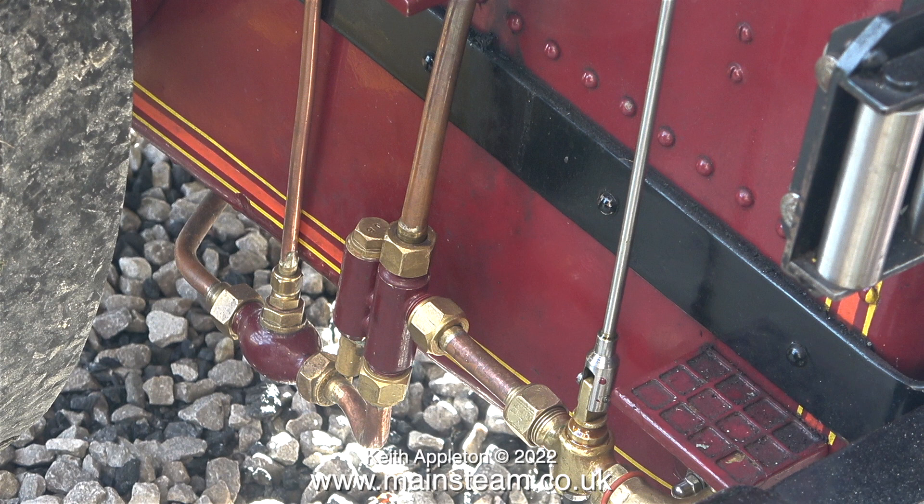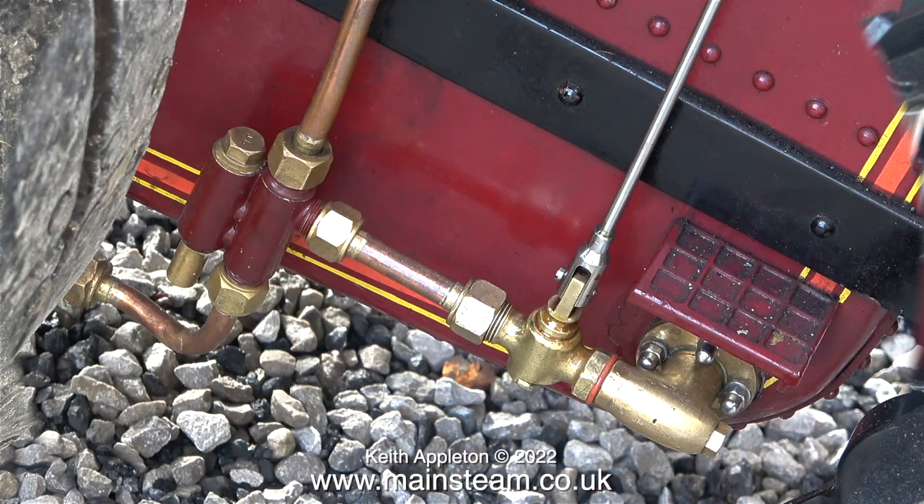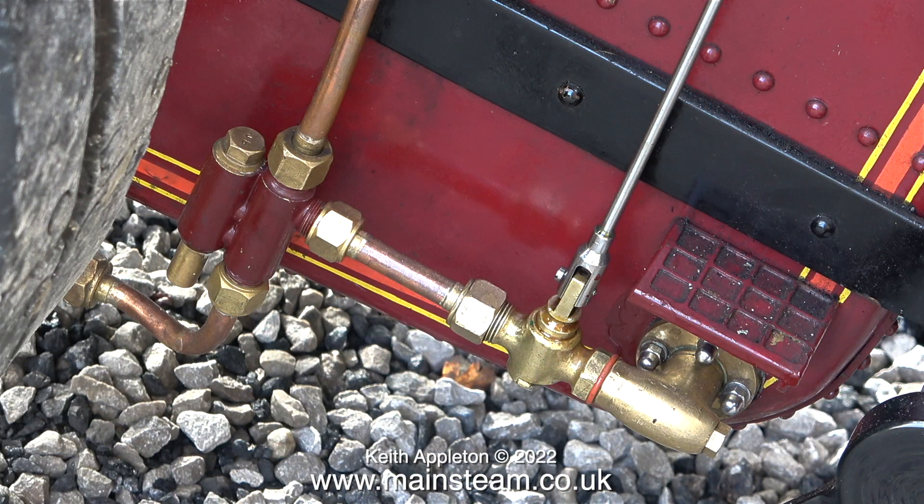When I think about it, over the years I've only ever used Jubilee Fittings injectors and never had any problems. This is an old number eight injector, and I bought a new number eight injector. When I fitted the new number eight injector to the traction engine the problem remained - it was exactly the same as with the old one. I'm pretty sure there is nothing at all wrong with these injectors; it is something else.